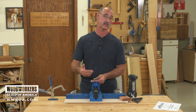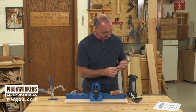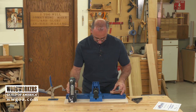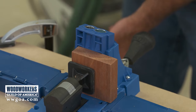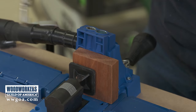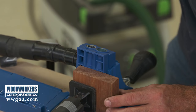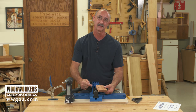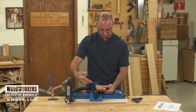Different sizes are available depending on which size pocket hole you're using. Our material has already been cut — the owner's manual for this device tells you what to do there. What I'm doing as I look down here is visually aligning the material with the guide hole that I'm about to use. Let me get my vacuum connected. And that's our plug — pretty cool, huh? In just a second I'll show you what we need to do to release that plug from our material.